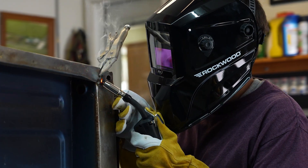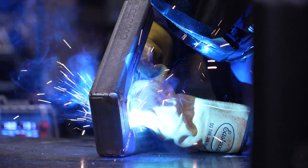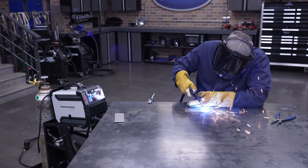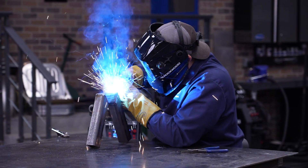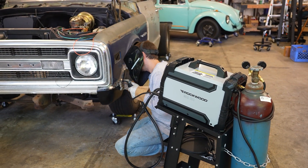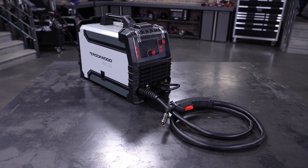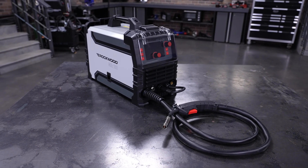These protections make the machine beginner-safe, and with a one-year limited warranty from Eastwood, you can rest assured knowing you're in good hands. As a MIG welder, it's ideal for mild steel, stainless steel, and even aluminum. It can weld 24-gauge sheet metal up to about 5/16-inch steel in a single pass when using 240 volts — perfect for body panels, tubing, and most project car repairs. With a dedicated setting and the proper lead length, the MIG-160 can also tackle aluminum panels without the need for a spool gun.